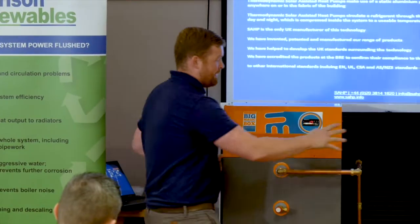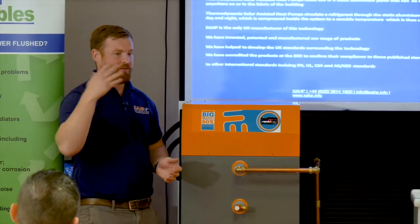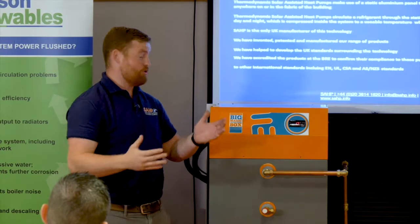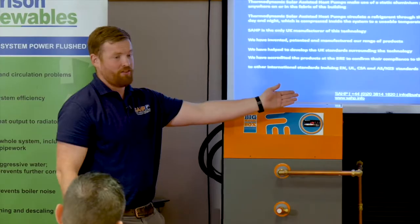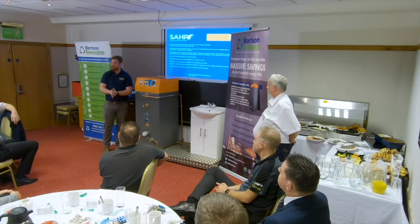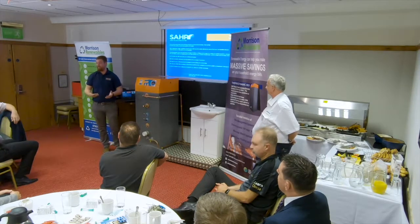We make use of a big black panel — there's a big black panel behind the product here that goes on the outside of the property. We circulate a refrigerant through that, and it's about minus 20 degrees. Through the second law of thermodynamics — enthalpy — if you've got something that's warmer, it's going to absorb the heat, going from hot to cold, like your cup of coffee cooling down. Your ambient air temperature surrounding that evaporator warms the refrigerant circulating through it, and it's that capture of energy that really gives us that efficiency.